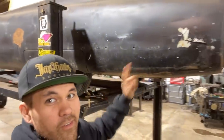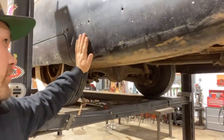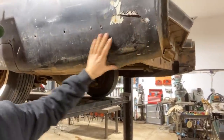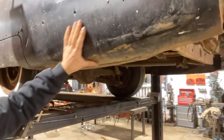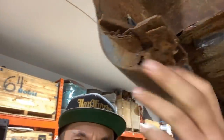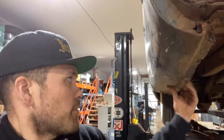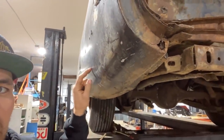So we're going to get to work on Christina's Cadillac. You can see there's rust that just came out — this is rusty. This is going to be a cool panel to make. From the wheel lip all the way back here, it's got a bit of crown going through this area. There is some forming that needs to happen up in here, and this is all rotted too. So I'm going to make this in a couple different pieces. The main piece is going to be this outside panel — this is all the rot that we're fixing down here.